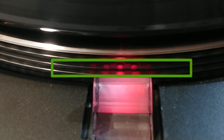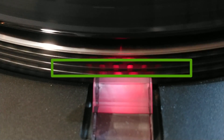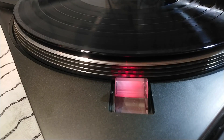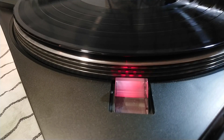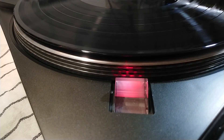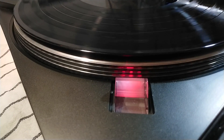Welcome to a deep dive into troubleshooting this lovely mid-90s Technics SL-BD22 turntable. The strobe dots are for adjusting the platter RPM and it should be possible to get the dot completely still using the pitch knob. My dot wobbles back and forth, which indicates periodic speed fluctuations known as wow and flutter.